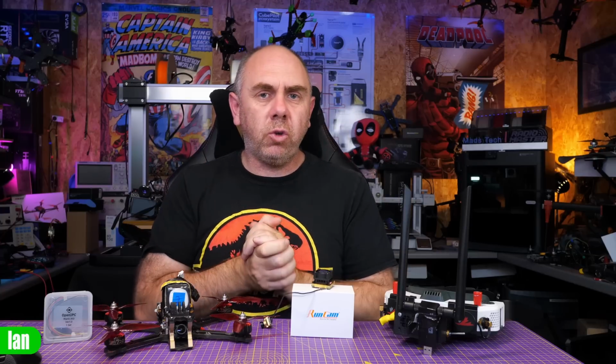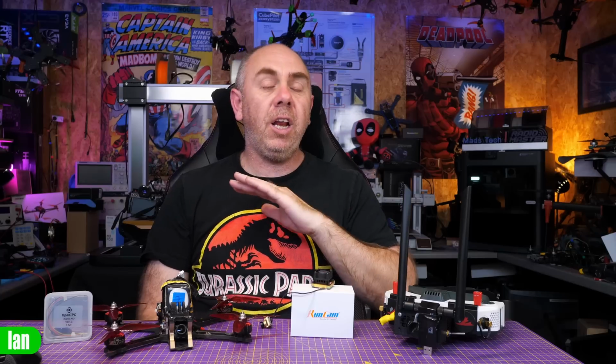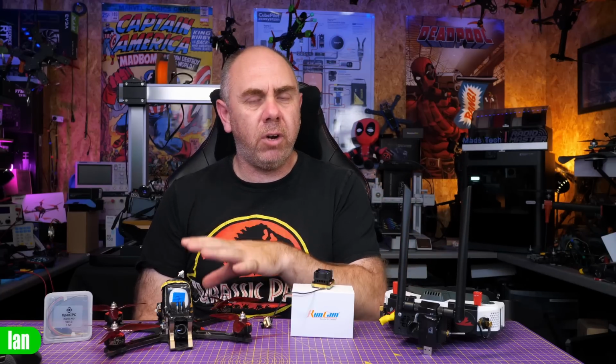Now, to start, we're going to talk about the Runcam Air unit from a hardware perspective. It's not great. It works. There are some real quirks here. The design is terrible. Runcam have done a bit of a quirky thing here where they seem to have designed the camera board themselves and used an off-the-shelf board for the RF side of things. The way it mounts on one side is just terrible. It's poor. It's going to break if you're not careful. It'll be fine in a plane or a wing, but in a quad, you have to be really, really careful.